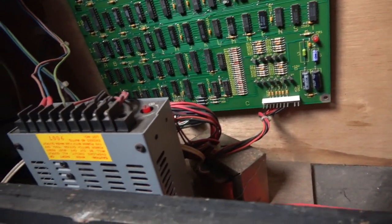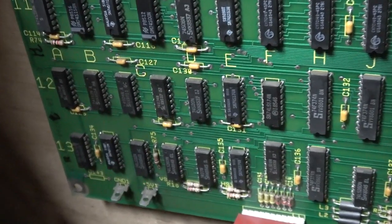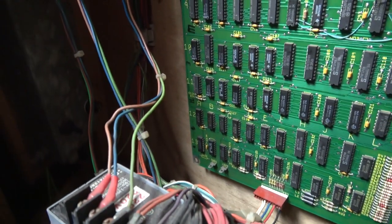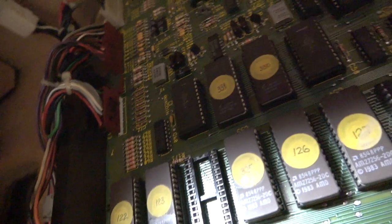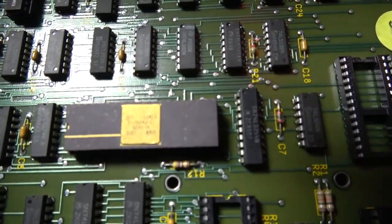There's a very old switching power supply. I tested the 5 volts on the connectors and checking points on the board itself — it's always good to check on the board, especially with these System 2 boards. Look at this cable harness — it's huge, same as the Championship Sprint. You lose voltages naturally due to resistance on the headers, and some of these headers aren't on very nicely.